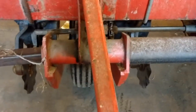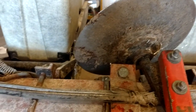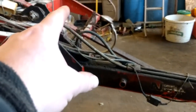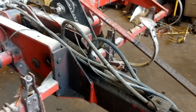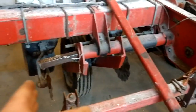That's the weak spot on my corn planter. The way the marker rolls going forward, it pushes against the corn planter — when it cuts in, it pushes up on the planter. It doesn't do it as bad when I have the markers set long, running my tire in the furrow mark. But when I have them short, running down the center of the tractor, it's really bad at lifting the planter up and taking weight off the seed units.